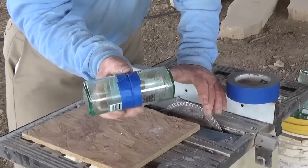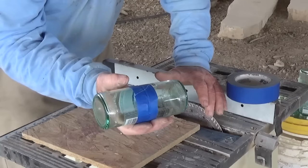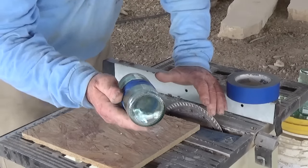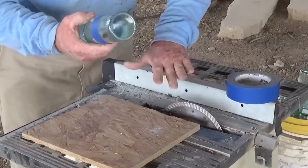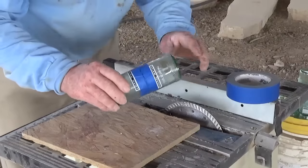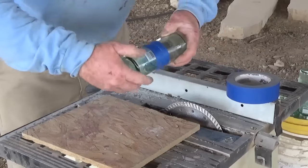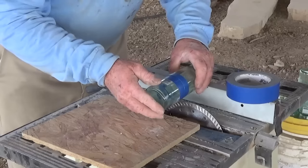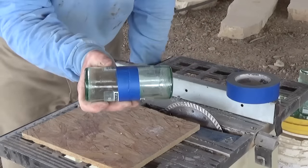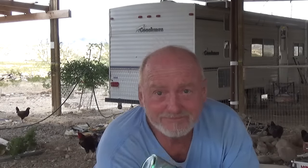So that's how I make bottle bricks. I'm doing about 400 of them — it takes pretty much a day, and then it typically mortars in like anything else. If you're interested in doing something like this, go ahead and give it a try. I would recommend getting a nice diamond blade and using your table saw like this, unless you need a straight cut or you want to cut an angle — a 90 or a 45 or any kind of angle you want — in which case you'd want to use a wet saw. But the dry saw worked perfectly, and you can see I taped up the rough edges anyway. Until next time, it's Robert Earl out here at the Eco Ranch saying bye for now.